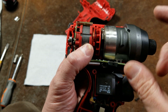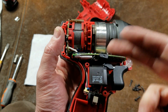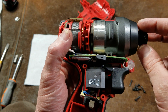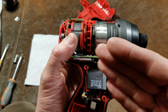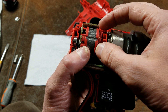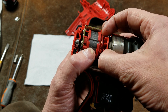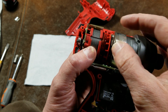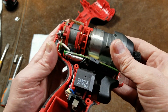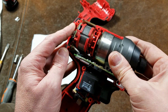In power tools you need a sensor, because when brushless motors are driven blindly — where the field just starts rotating — if the motor has a lot of load it will stall out and shimmy back and forth. With sensors the motor can say 'I'm having a hard time turning, I need to keep certain fields on longer until I detect the motor has turned some, then switch to the next set of fields.' It's interesting that drones don't use sensored brushless motors because they simply don't need them.